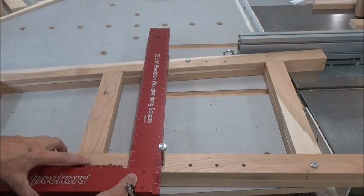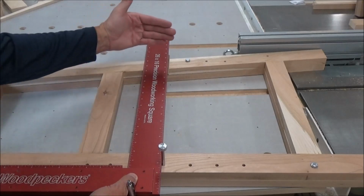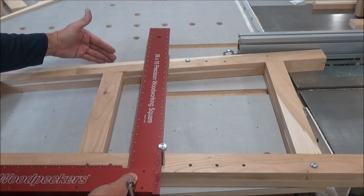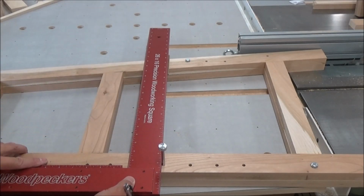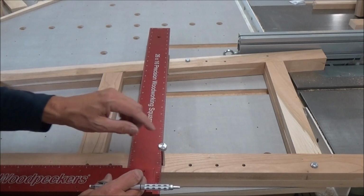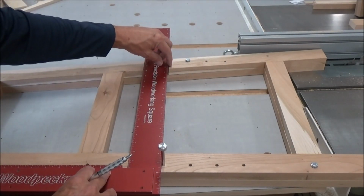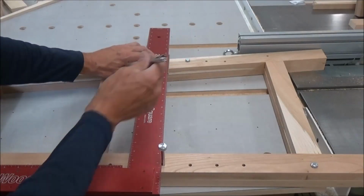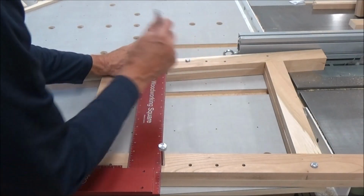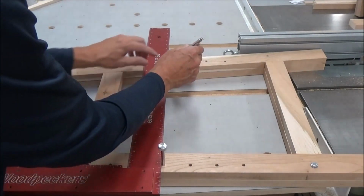So it'll be a big time adjustable stand. But my problem is that shelf is going to stick out even farther. So I'll see what I can do about that as well. So what I'm doing here is I've pinned this hole, ran my square across, got an 1/8 inch offset to give me my center line. This hole will be near the inside, so I can mark that.